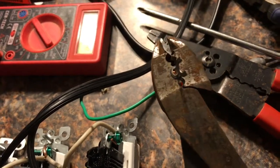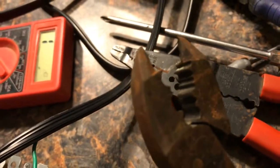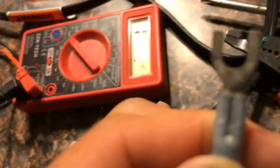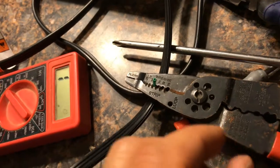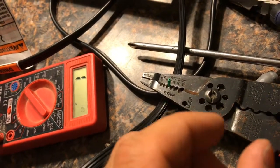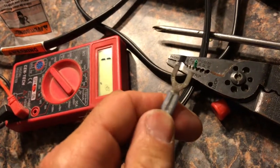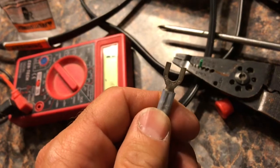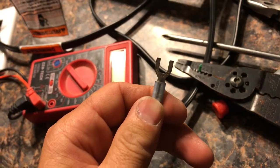Make sure you've got a good pair of crimpers. If you have a skinnier pair, do a double crimp — crimp it down, move it over, do another crimp. See how much surface area a wide crimper gets? A narrow crimper risks breaking the wire. You can still use them, but do a double crimp for a nice sturdy connection. You don't want loose connections on this stuff because that creates heat — worst case it could start a fire from a bad connection — so really be careful with your crimps.